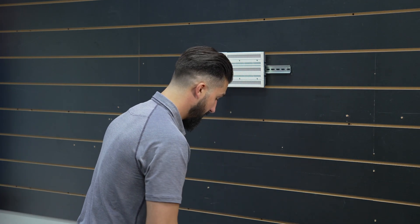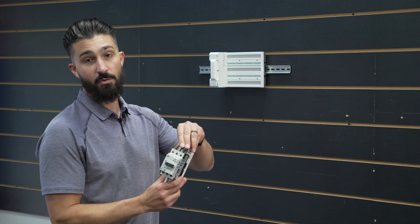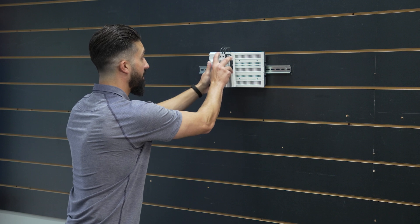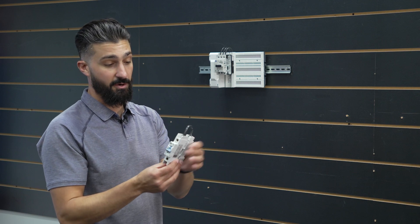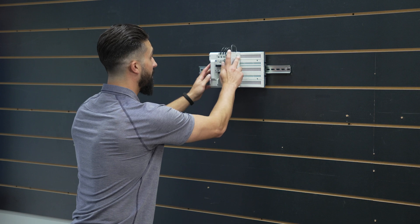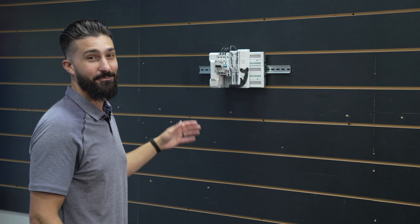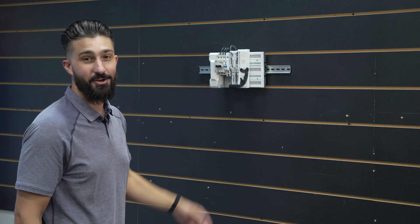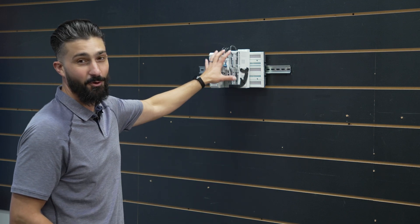Once you have power run to your Crossboard, you can start adding your end devices. I have a motor starter here — we've already wired it to show you the ease of use. Once the device is wired, it's just plug and play. You can do the same with any other devices, such as a mini circuit breaker. Once your Crossboard is powered and your devices are on the board, there's no additional wiring except to your end devices — motors connect to the motor starter, anything going to your circuit breaker gets wired there. You're not wiring the devices twice; it's just plug onto the board and then wire your end device.